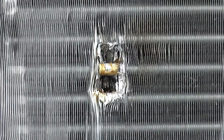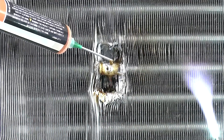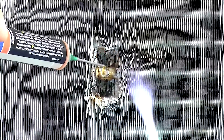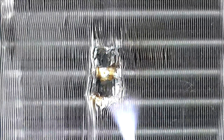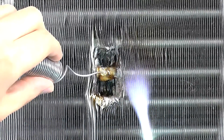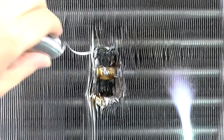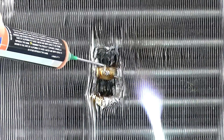Don't use the flame to melt the solder. Instead, the base metal should be hot enough to melt the solder on contact. Now it is possible to overheat the flux and burn it. If this happens, the flux will turn brown and the solder won't flow right away, but that's okay. Just add a bit more flux and a little more heat, and you'll see that solder smooth right out.